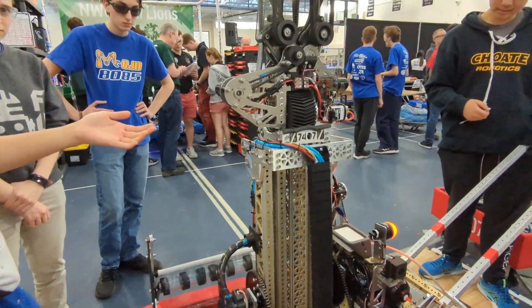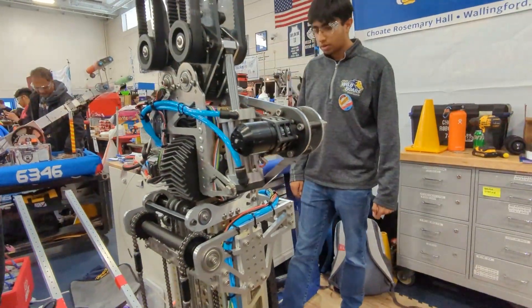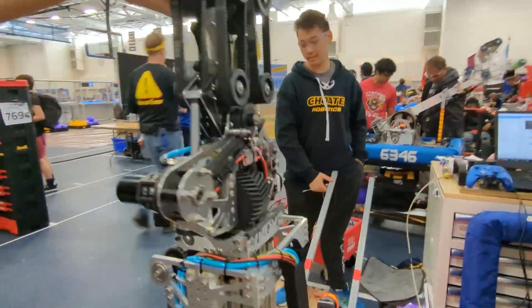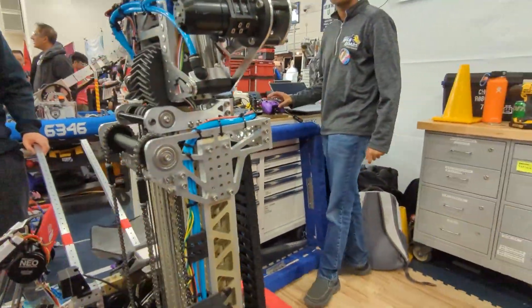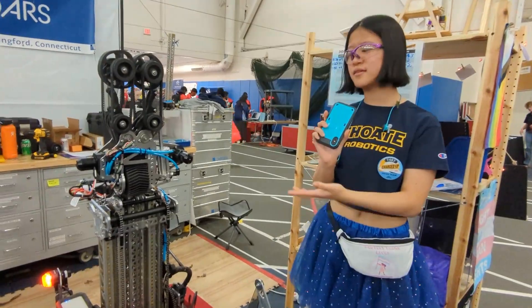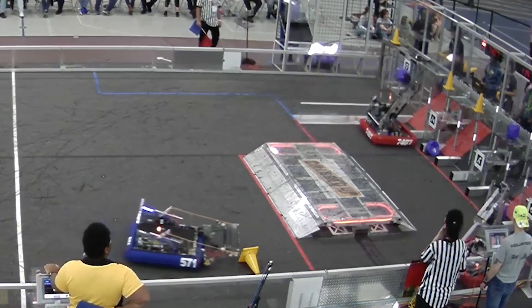The second degree is our wrist mechanism, in which case we have a double-printed double herringbone gear that allows our wrist to flick up and down. The third degree of freedom is our linear motion — our elevator. Shout out to Thrifty Bots, one of our main sponsors. We made this elevator from Thrifty Bots, and it allowed us to manufacture the elevator in under two weeks once the season started. That gives us the linear motion we need to reach up and score high cones and high cubes.